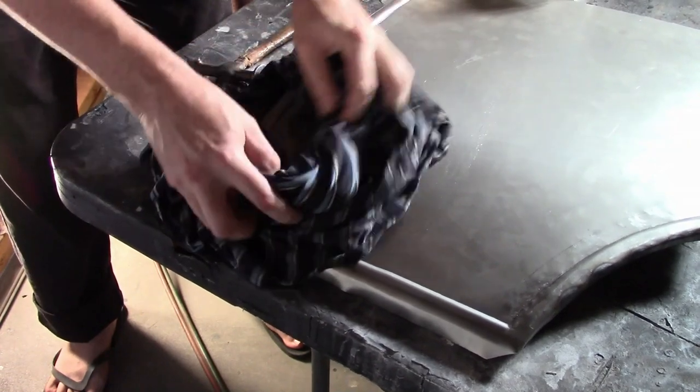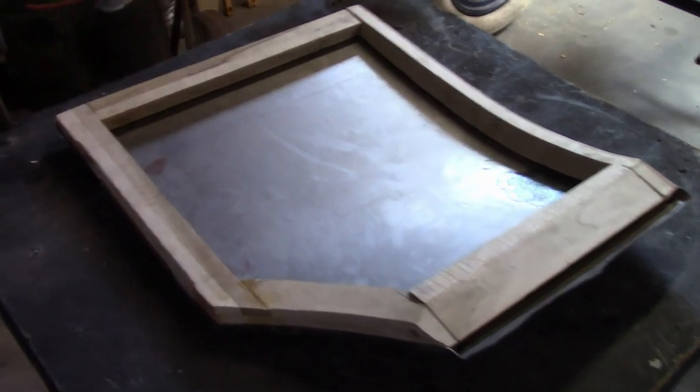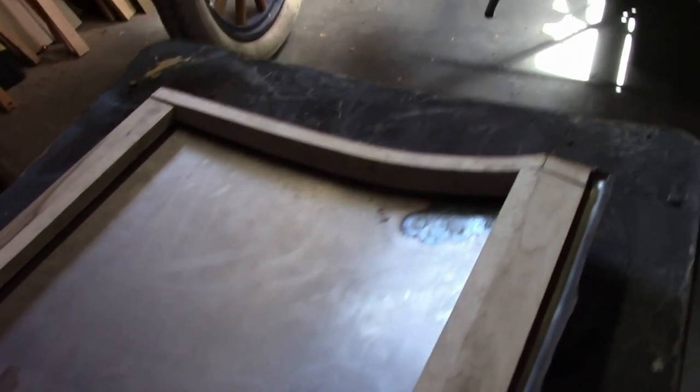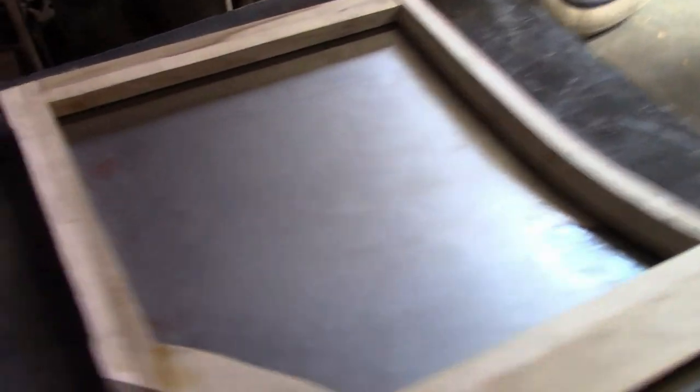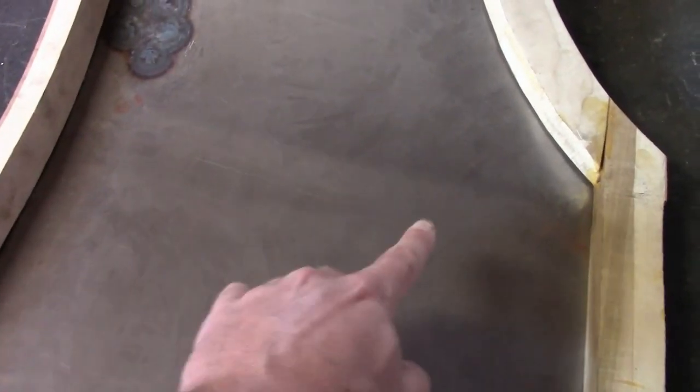So let's go ahead and get it — and that pretty much fixed it, so it's usable now. I've also attached the wood frame to it, and the back of it just conformed into place really well and is sitting properly, so that's good. Now here's the wood frame, which like everything else is not quite finished yet — just good enough to start aligning everything. Where the hinge goes, I routed this out about an eighth inch so the hinge sinks in there like it did originally. It's missing the tack strip that's supposed to go across the center, and there's supposed to be a block here to hold the door latch, but again not necessary for aligning it, so I just left it out for now.